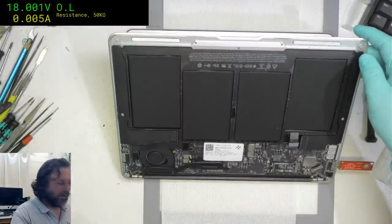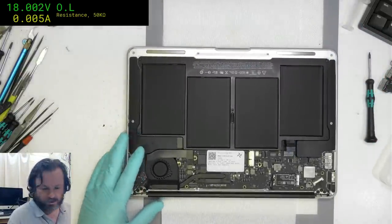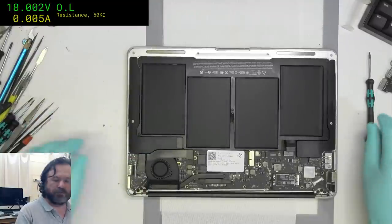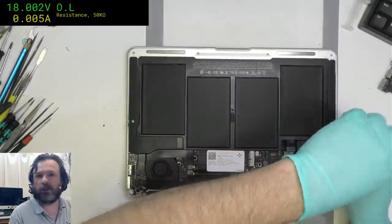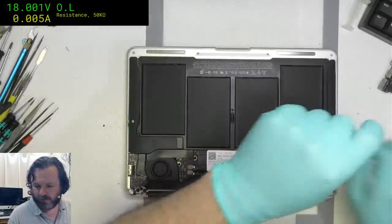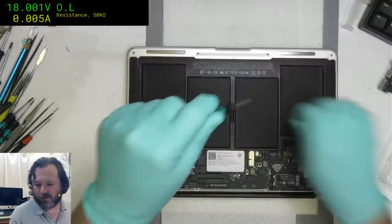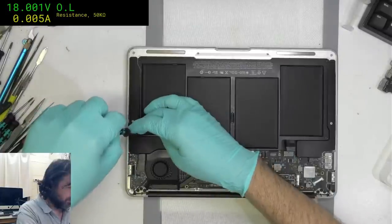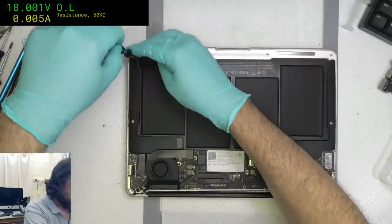Alright, crap. Alright, okay, so when we get this sort of behavior where the machine seems to be running perfectly fine when it arrives here, we typically know to expect that we've got some sort of corrosion somewhere, and the process of shipping has shaken things around, crumbled the corrosion, and just changed the parameters slightly, which now make the motherboard boot again.